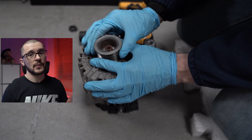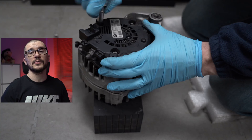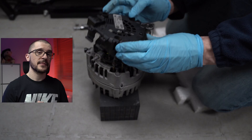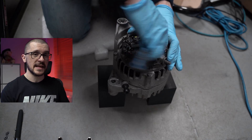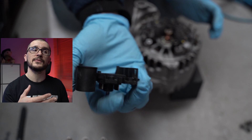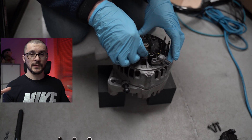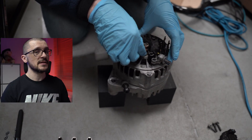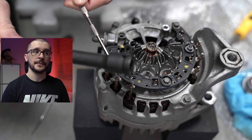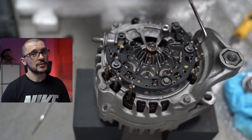The main unit is quite simple to take apart. It doesn't have a slip clutch, which will allow you to remove it quite easily. The rest are just bolts. But here you're gonna see my first mistake — I thought that I needed to remove everything for the alternator to come apart, and you will see me starting to undo and desolder the main wires for the stator, which was a big mistake.